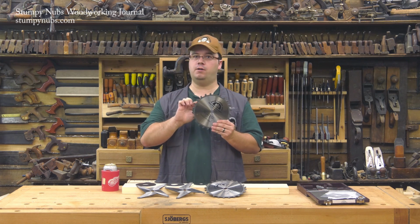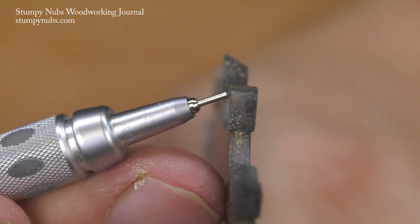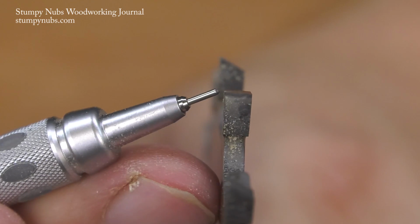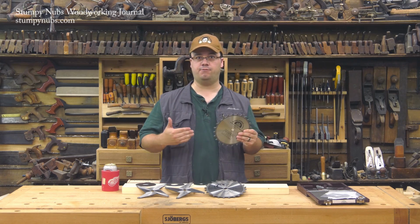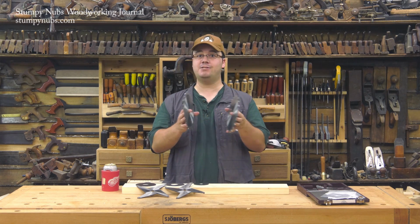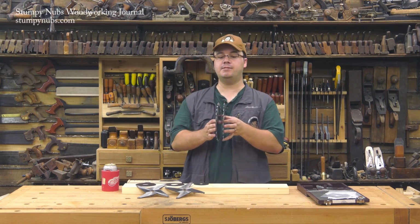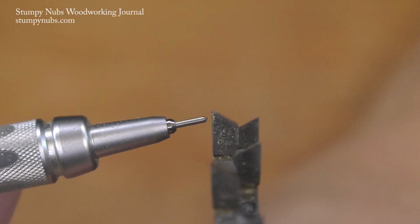Now, not all of the teeth on the outer blades are angled. Every 6th tooth is ground flat across the top. These teeth are called rakers, and they're designed to cut out the middle of the kerf, making it possible to use the two saw blades together and still get a flat bottom cut. Otherwise, since you're cutting with points on your outer surface, you'd end up with a V bottom.